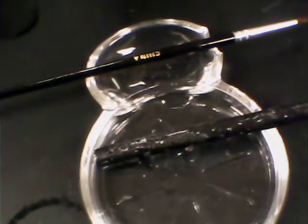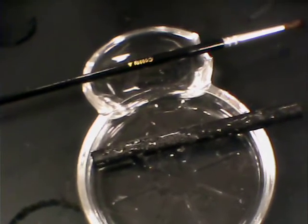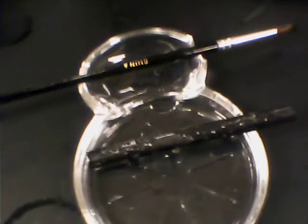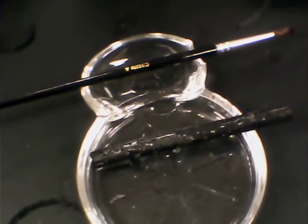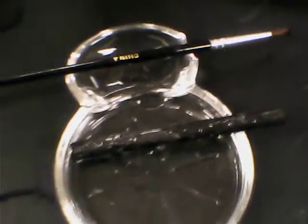The next thing I'm working on is gel electrolytes, which will be saturated with aluminum chloride. I'm trying to get away from sodium hydroxide — I'll sacrifice voltage. In fact, with a freshly prepared battery today I hit 1.42 volts. It's all a question of securing the casing and the graphite electrode and making sure they don't short. Anyway, I'm making gel electrolytes and I have a video uploaded.